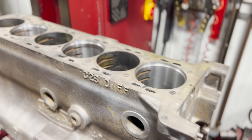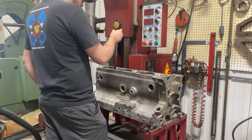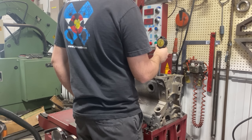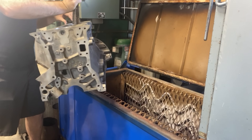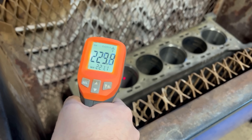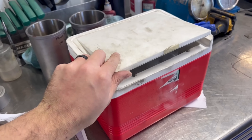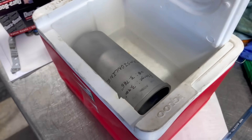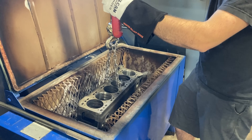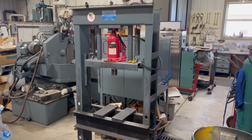At this point every other cylinder has been machined to accept our new cylinder sleeves. Before going ahead with the install I made one last double check of all of our dimensions just to be safe. In order to safely install the sleeves we decided to use a temperature differential to our advantage in order to easily overcome the press fit. The block was put into our bake oven and brought to a temperature of about 250 degrees Fahrenheit. A bore gauge indicated that our bore diameter had increased about four thousandths of an inch, giving us a two thousandths clearance fit. To increase the clearance even more, the sleeves were soaked in liquid nitrogen which boils at around negative 300 degrees Fahrenheit. However this presents a problem because when the sleeve equalizes to the temperature of the block it actually increases in length and can push itself up slightly away from the counterbore, so we have the press ready on standby.